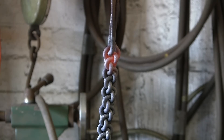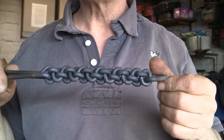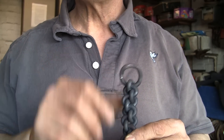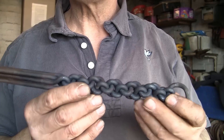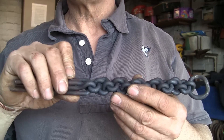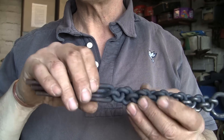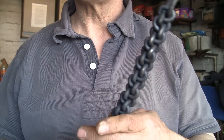So let's cool it out and have a look. Cooled it out, and that looks quite nice — it's quite straight, quite even. Apart from that bit at the top, which isn't particularly even, but I'd get that right next time. It's only for hanging it on whatever you're going to put the handle on — but the rest of it has come up quite nice and even. If I forge welded it I'd sort of weld these up and then draw them out into a sort of square or whatever it was going to be. I'm not really sure what I'm going to put it on yet, so I'll leave it like that for now.